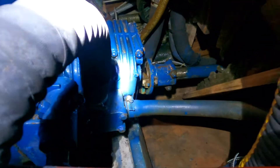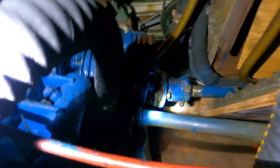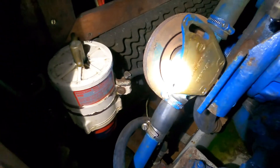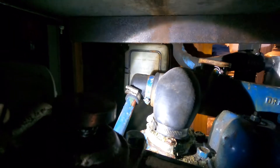Alright, one last check. I've got my hose going into the engine there. Follow that around — goes to a diverter, which is shut off for the generator. Goes to my extension hose and then over to the bucket. Then over here, it goes into the engine, into the gearshift or the transmission. Transmission cooler right there. It goes to this line, goes to the water pump where I've removed the impeller so that's not slowing the flow. And then that goes to my front of my heat exchanger, which is right there.